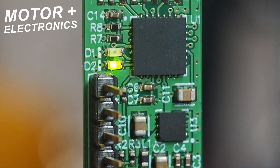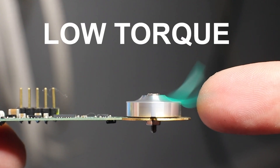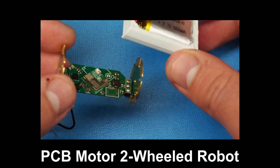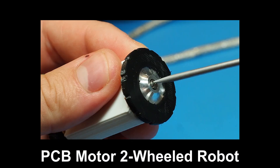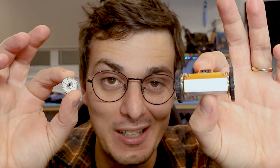This PCB motor already solved half of the problem. Its only drawback is the torque, especially because it needs to directly drive the wheels. But I feel more confident using it after building this two-wheeled PCB motor robot. The good news is that by adding two more wheels we'll also be directly improving the driving torque. The remaining challenge is using the same circuit as a robust shell and fitting all the electronics inside — that's definitely a big headache.